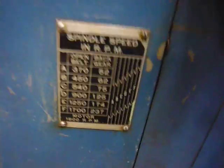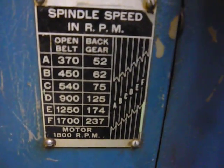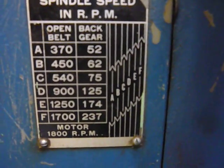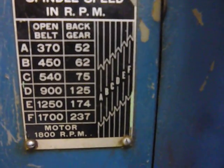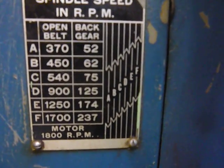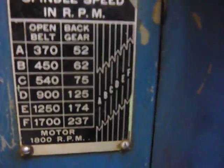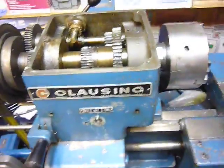There's a nice little chart up here in the front of the lathe. So normally you'd be running this at 60 hertz. I've got it in D now — the D pulley selection. Those are just arbitrary labels: A, B, C, D, E, F. But in D, we should be looking at 900 RPMs. I'm not messing with any of the back gear or any of that stuff — it's just the straight drive up from there, no extra reduction.